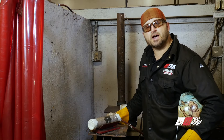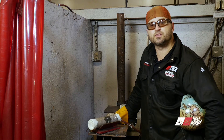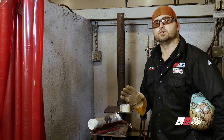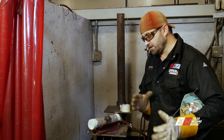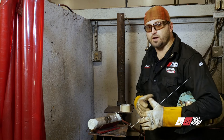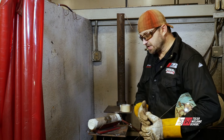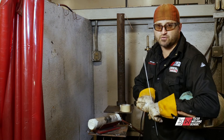I've had a lot of students ask me about this — they were wanting to see it on YouTube, so here it is. I've got it all set up and ready to go. On your two-inch Schedule 10 stainless, it is critical that you get a good fit-up. Whenever you cut your pipe or when you fit your pipe, you need to make sure it's got a good fit-up. You don't want a bunch of gaps in it, not when you're doing Schedule 10. Make sure you've got a good straight cut. If not, grind it, square it up, make sure you've got a good match whenever you're putting them together.